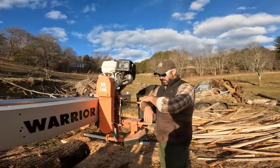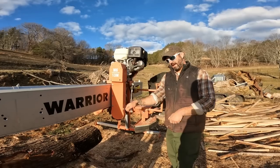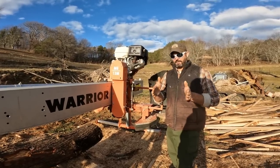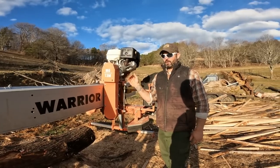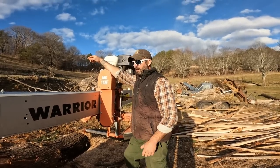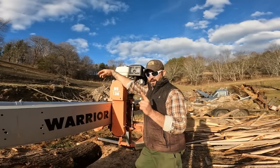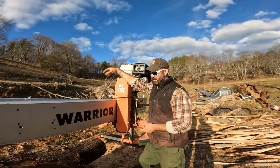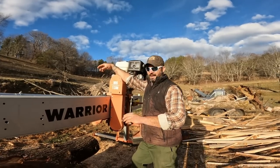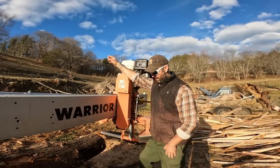Instead of a band mill, that's got the big band saw blade. It cuts one way, you have to move that slab, you have to cut all the slabs, and then you have to take those slabs, turn them up, and cut them again. So with a band mill, while you can cut bigger lumber generally, to get one dimensional piece of lumber, you have to touch the piece of wood 2 times. With this swing blade for cutting dimensional lumber, every time I go down and back, I have a dimensional piece of lumber instead of having one wasted trip. With a band mill, you have to walk back, nothing good happens. Kind of a brilliant idea.